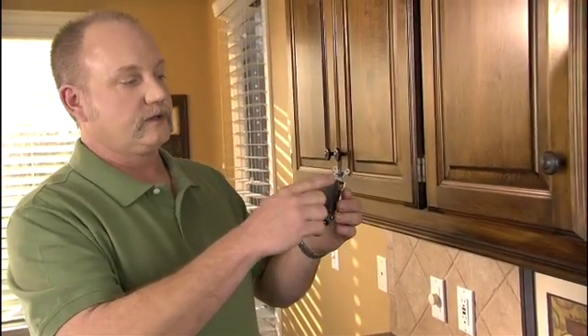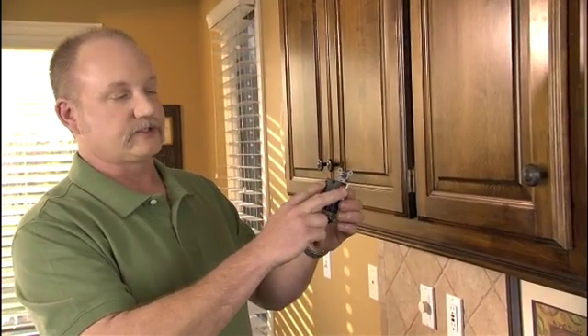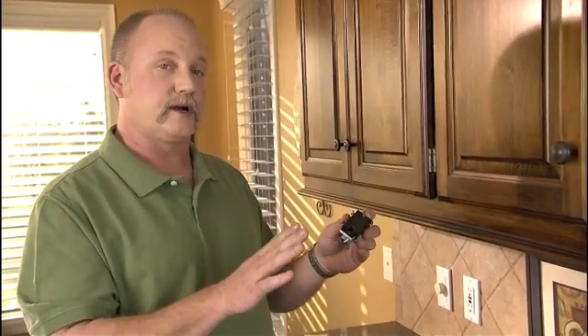When you have a three-way switch, make sure you have two wires that are the same color — both of those wires go on the same color terminal. You'll have an odd colored wire, and that will go on the third terminal of the switch. You'll also find that you have a ground wire. All of these devices we've talked about today have a ground wire — there's a reason they're there, and that's to protect you and your family from electrical shock.